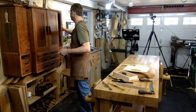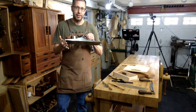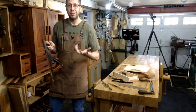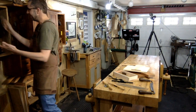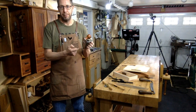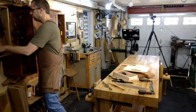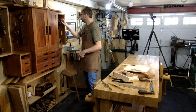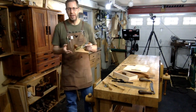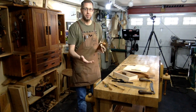The spokeshave is really meant to be taken at an angle — shave off a corner and shave off a corner. If we go through typical hand planes: for hogging material I'll use a heavier mass plane like a number four with a radically cambered iron. That curvature creates a scooping action which not only reduces tearing but makes it easier to take big heavy shavings. The scrub plane is smaller but has an even more radically cambered iron, allowing you to take those heavy scooping cuts. As we move into finishing and smooth planing, we get down to smaller planes.